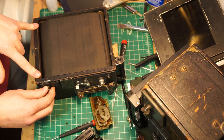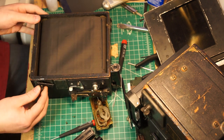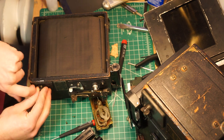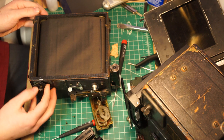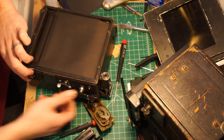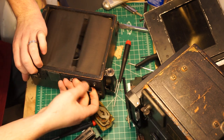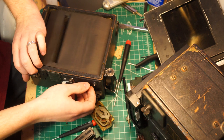Don't go farther than you need to go. You don't need to pull this entire piece apart. What you really need to do is find out how to sneak as much lube in there as you can, and then just add some tension. We'll release a bit of tension on this. Let's go back to zero — we don't have any tension now. As you can see, it's just buckling up there.